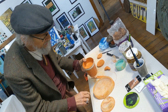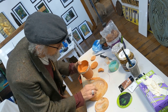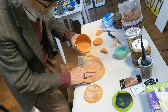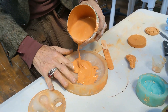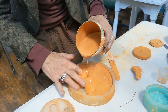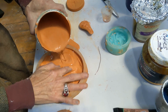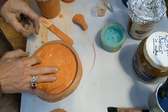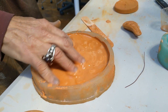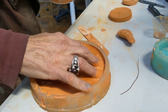Make sure the mold is clean. Plaster is basically non-toxic — it's very inert gypsum; if you breathe a lot of dust it might line your lungs, but it's not hazardous. What I do is a little bit of rubbing with my finger — if you have a good vibrating table that helps, but nothing beats using your finger to make sure the plaster gets into all the crevices. You get to know your mold and where it needs the most attention: if there's a nose, you can be sure you'll get a bubble right at the tip.